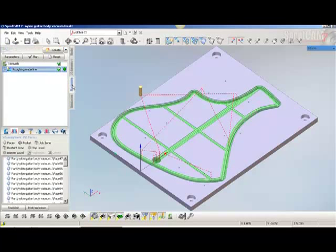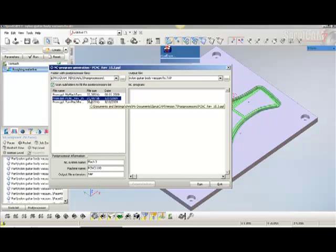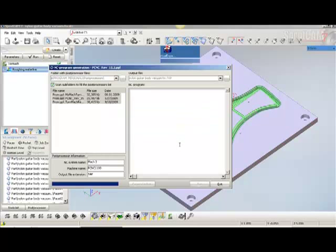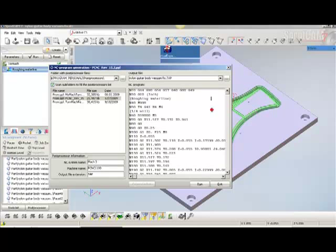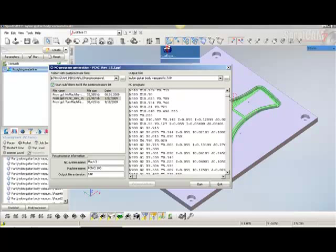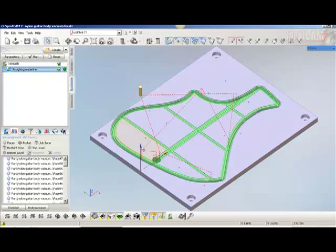We'll go into machining. Let's save this file. Okay, we'll go over here, saved it, and apparently I've reused it. And then we'll go post-processor, and in this case I'm going to use the Tormach processor, and we'll just run, and apparently it's going to update that file, and that's your G-codes, and your G-codes are ready to be inserted into the CNC machine. Let's exit out of this. Your coordinates here, you see this blue arrow and you see this red arrow. This is your 0, 0 point.